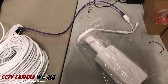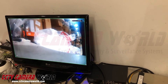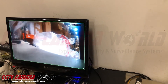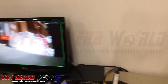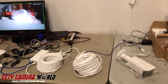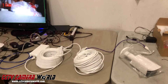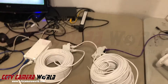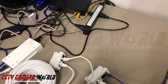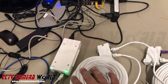I'm going to show you how much delay to expect with two extenders. Waving my hand — about the same amount of delay as before. This is the closest to real-time you'll get with 4K, 2K, or 1080p IP-based video camera systems or PoE cameras. Some people ask if you can add two cameras — you could, as long as the total power draw doesn't exceed what the PoE injector can provide.